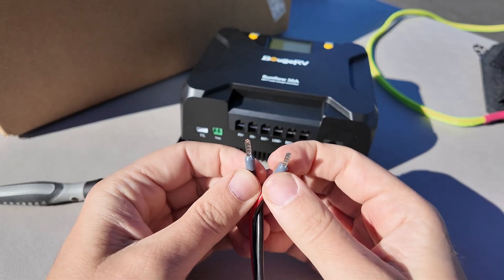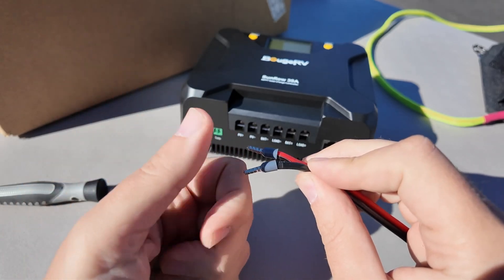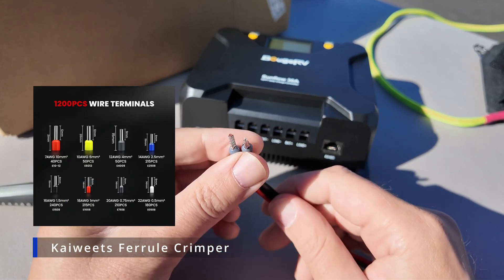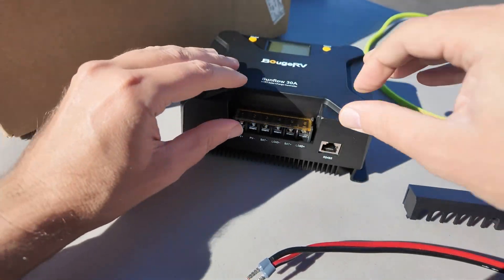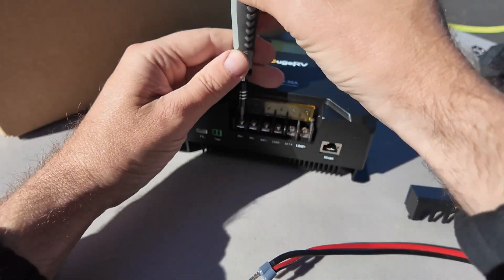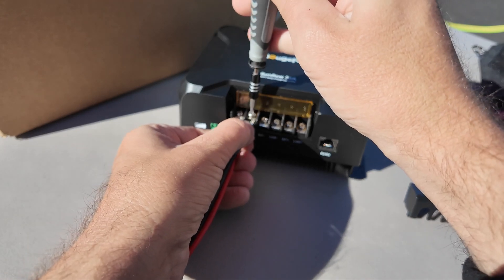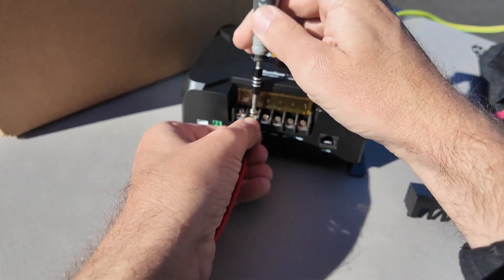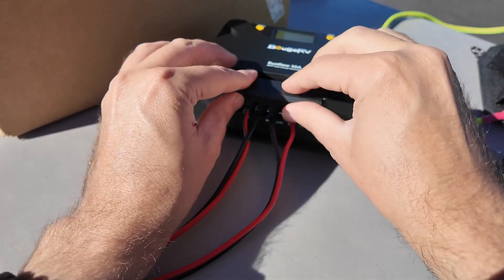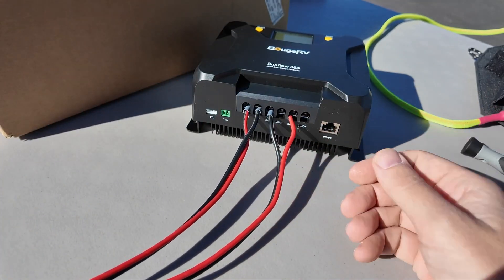On the business side of things, I made up a nice little set of cables with ferrules on them, which are fairly easy to put on — you find the right size, shove it over, and run a special crimper. I've got a link in the description for the crimpers. The access hatch comes off, tilts up out of the way, and we're going to plug in the solar panel first. The best part about ferrules is no frayed wires to deal with. Get that in nice and tight, fold it down, and it's all covered up and nice and pretty.